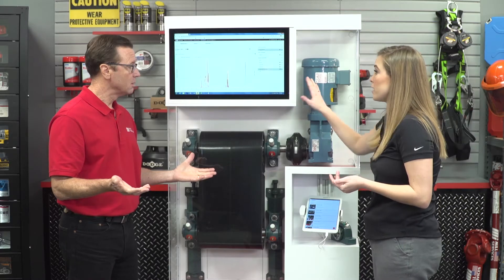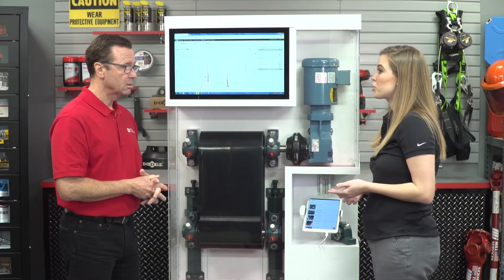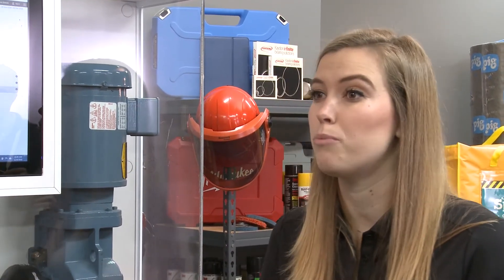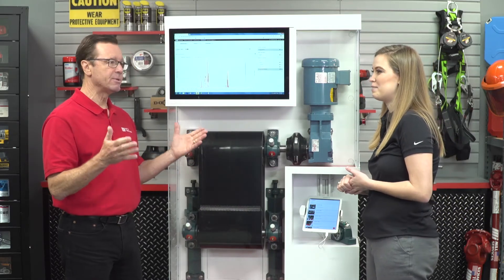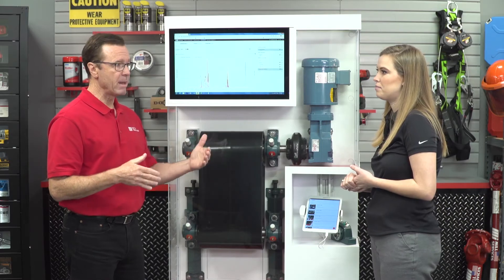Based on the reading we can see that action needs to be taken, and we can then reference the instruction manual for that needed action. If this were an out-of-tolerance vibration signal, the maintenance manager might begin to locate a replacement bearing and schedule a swap at the next most convenient time — better to do that before failure, because downtime is extremely expensive.